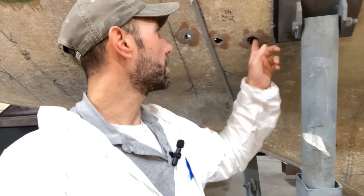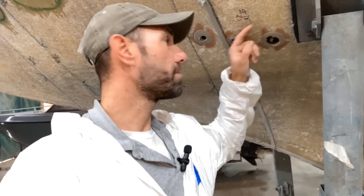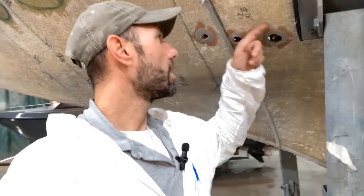I'm going to do exactly the same thing with these heads seacocks here, because we're not sure yet exactly what the layout of the heads is going to be once it's been rebuilt. But there's a high probability that the seacocks are going to move from where they are now. So I'm going to mix up some polyester filler and chuck that in the holes with some tape on the outside. That will cure quite quickly. Then I can come back in with my little grinder and prepare the outside for some glass to be laid up in those holes. And then when it comes to doing the inside, all I need to do is grind through my polyester filler until I get to the glass which I've laid up on the outside, and I can finish the repair properly at a later date.